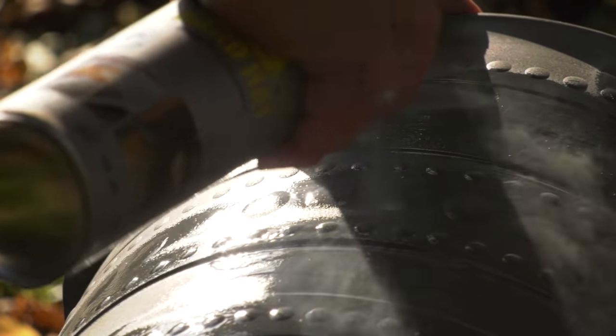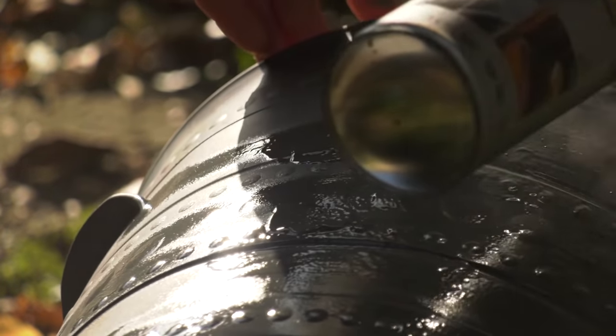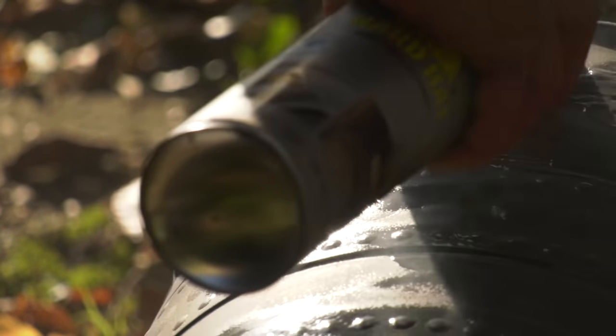And I think the car paint sprays are one really good way to go, and you can get quite good lead colours, sort of grey galvanised colours, in the aerosol spray, and you can just quickly spray them on and they seem to last forever. If you want a stone finish, then you can use a masonry paint. If it's a smooth masonry paint, you just add in a bit of sand, mix it into the paint, and then you get a slightly textured surface when you paint it on.